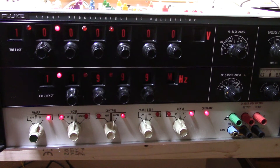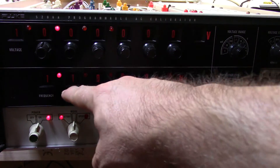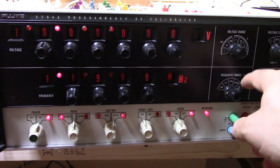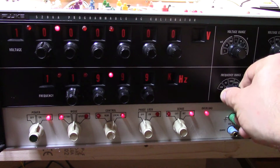I'm just trying to go through the various tests and calibration points, and one of them that it gets to is the high frequency compensation calibration. You're supposed to set the frequency range to 1.199 MHz. I've done that, and as soon as I tried to get up there, the overload light came on.